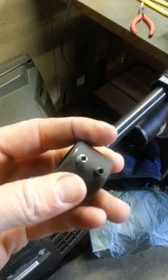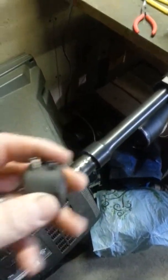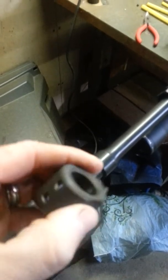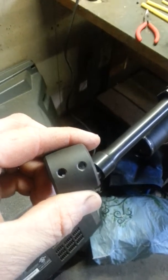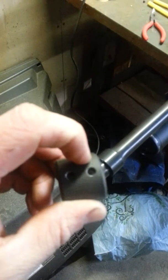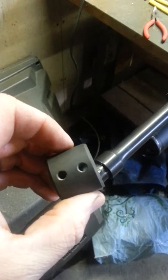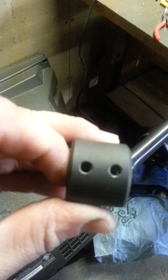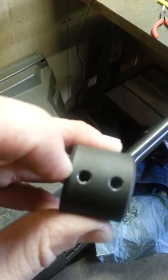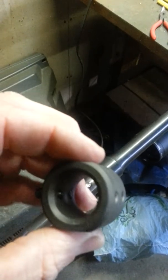It's made by Black Rifle Disease Engineering — or BRD Engineering. It's a barrel dimpling jig and it comes in really handy. It doesn't cover every single gas block, but most of them have this spacing. Regardless, it'll at least do one dimple for pretty much any gas block, because the gas port on the gas block is indexed off of the rear set screw.